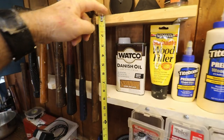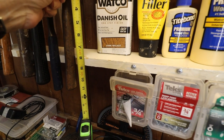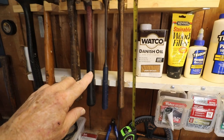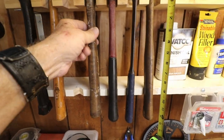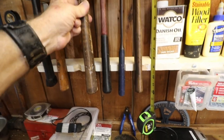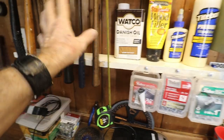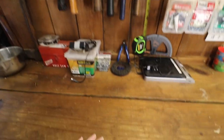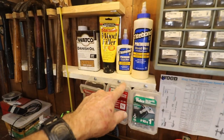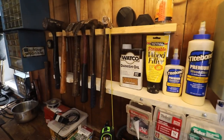Okay, so here we are with the one I've got. You can see from the top to the center of this one is nine inches. So the actual space off the bottom to the top is about seven and three quarter inches. But these are one by three and a half. There's your square slot, which allows your hammer to go in at the top. And then the V just helps keep the handle so the hammer doesn't lean back and fall out. If you have kids at the house, you might want to put a screw with a little hook and put a bungee cord across to keep the hammers tight against the wall so they don't fall on somebody's feet. But I'm over a workbench, so I've got it made.